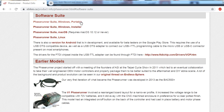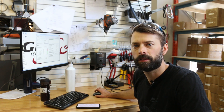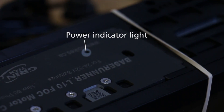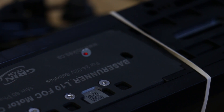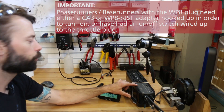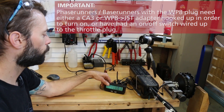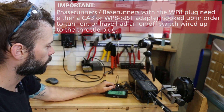The first thing to do is connect up the system to the computer, make sure the drivers are installed for the USB to TTL adapter, and then turn on the battery. I'll turn the battery on now — I've got everything connected up, and we can see the red LED on the controller is on, which means the controller has power. I also have a Cycle Analyst in this setup and we can see it's connected and powered on.